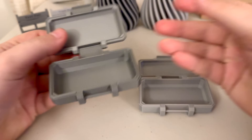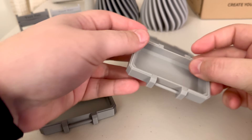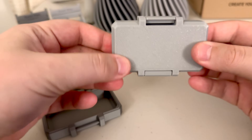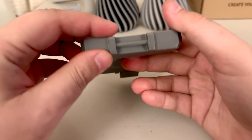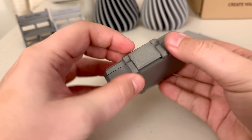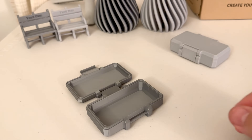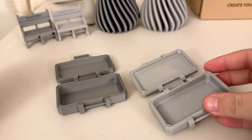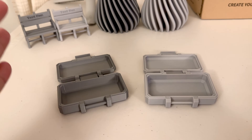All right, we got both of these finished up. I'm going to be honest — both of them came out pretty damn great. But I will have to say this round goes to the PETG. It's still pliable, still flexible, but it is snug and fit — the latch is secure, there's no movement in this box whatsoever. The PLA version had some issues printing the latch area and when you put it together it's just a little bit loose. But both turned out great. For durability and functionality, for what this design is made for — a strong case that is going to keep your things secure — PETG is the way to go.